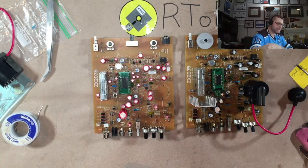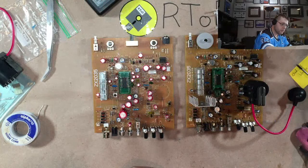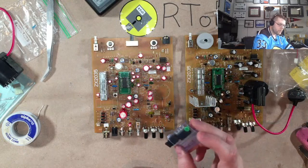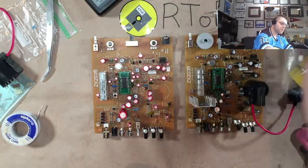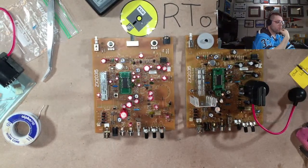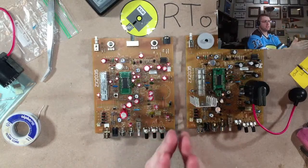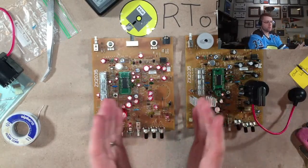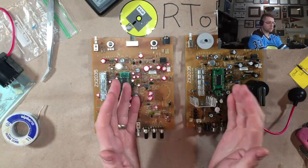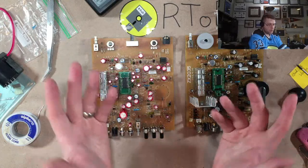Early on, I did a test with my transistor tester, and we measured the transistors that come with the kit and then the ones that I got off of DigiKey, much better quality parts. And I'm still not clear, because it's a little more electrical engineering than what I'm good at, but the beta was immensely different between the AliExpress parts and the DigiKey parts. Not a surprise. It really just shows that the DigiKey part can regulate power better. Again, not a surprise.